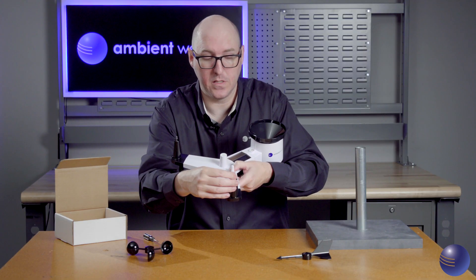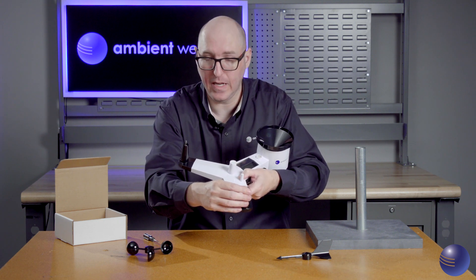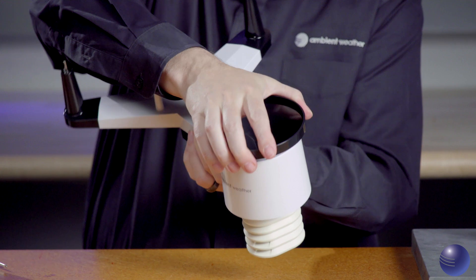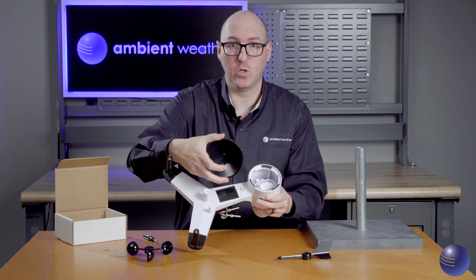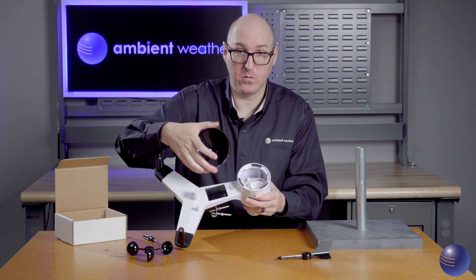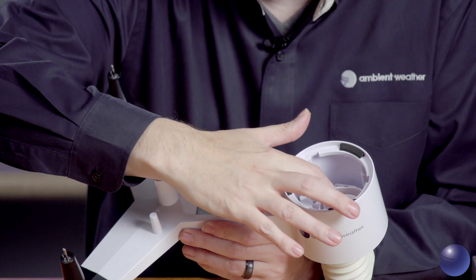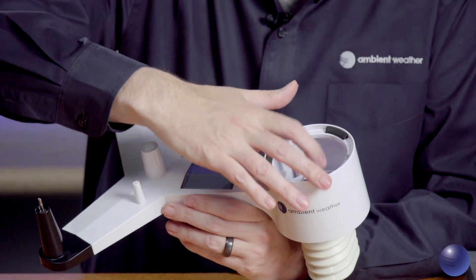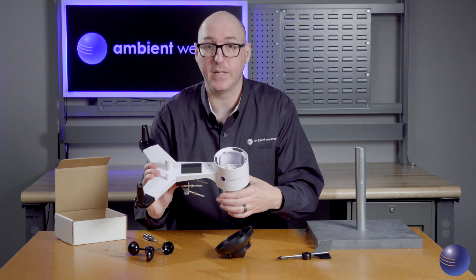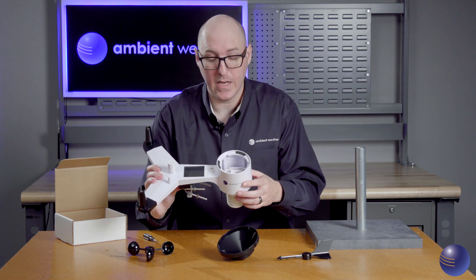Note that on the wind vane assembly there is one flat side — this is keyed specifically to hold the wind vane and not the wind cup. We're also going to remove our rain cup. Do a visual inspection to make sure there's nothing degraded, brittle, or clogged with debris. Then take a look inside the rain gauge mechanism to ensure the tipping mechanism is operating properly for accurate rain readings, and make sure none of the drain holes are clogged, as that can prevent the float from tipping properly.